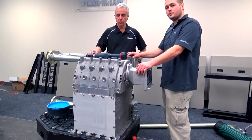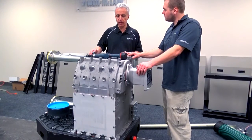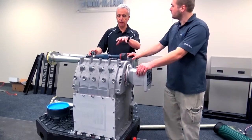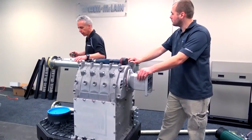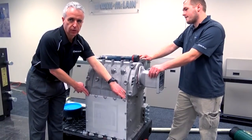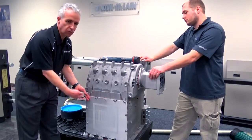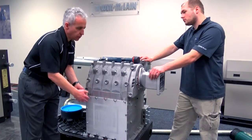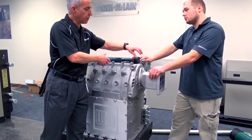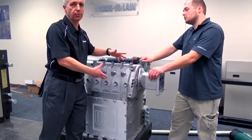Okay. And by the way, this step is also recommended when you perform your annual maintenance, which would include cleaning the heat exchanger. And on the front of the heat exchanger, you have the clean-out plate. So we recommend on an annual basis to remove the clean-out plate. We provide the cleaning tool. You clean the heat exchanger, and then you would remove the mixing tube with the burner and put the hose and just flush it down to clean it completely.